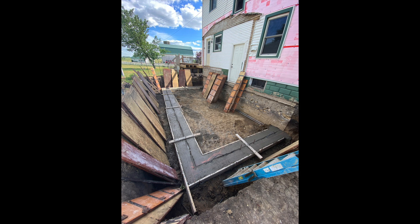So that is the footings poured. There's a couple chunks of rebar that run around the perimeter, and then as you can see there's a rebar that is bent in a zigzag pattern that comes in and out of the footing, as well as some bars that just stick straight out of the footing — that will all key into the walls. There's also a keyway in the center of the footing that will help keep the wall sitting nice and even on the footing and keep that wall from kicking out at the bottom. So this is forms in the hole right before the footing forms get stripped and the wall forms start going together. We'll jump into wall forms partially up next.